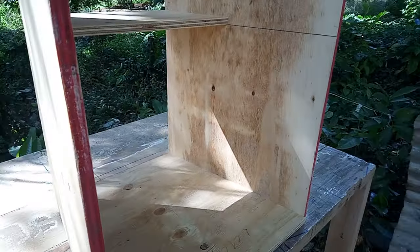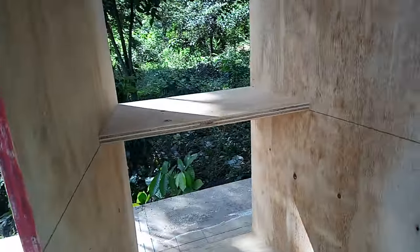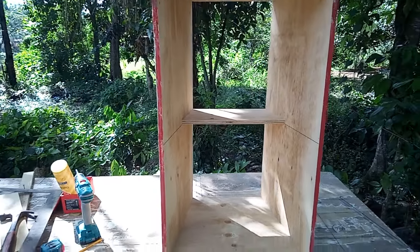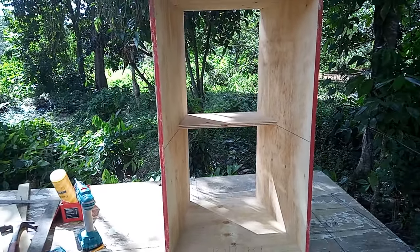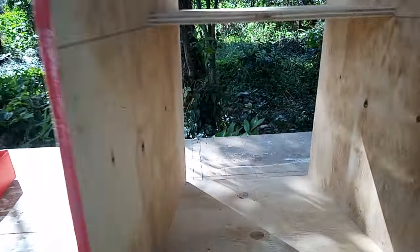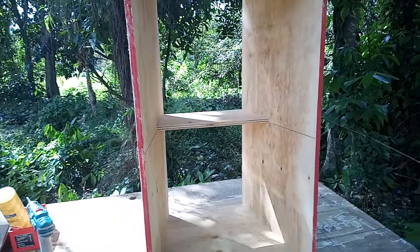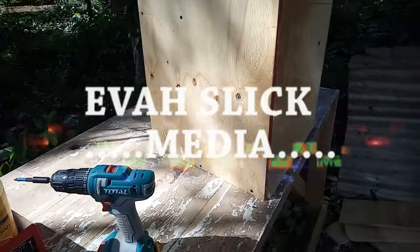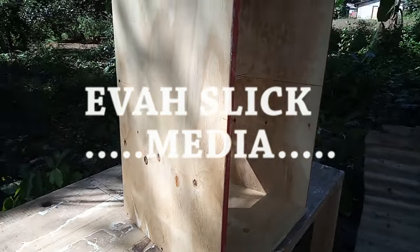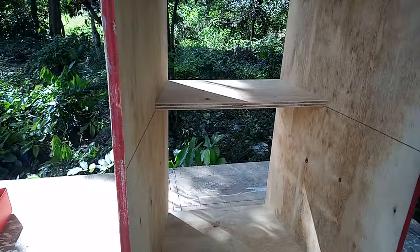My mid box — I'm gonna make a box where the horn and the tweeter are gonna fit, along with the 2x15. I'm gonna use two 15-inch speakers inside here. This box is gonna be small but huge — it's gonna have one 15-inch here and another 15-inch here, and also two horns and two tweeters inside. As you can see the depth — the length here is 18 inches across.